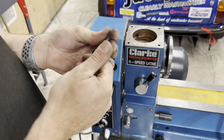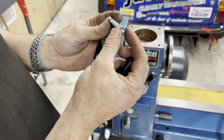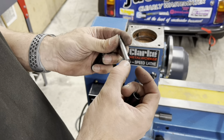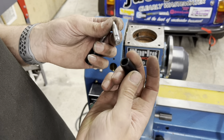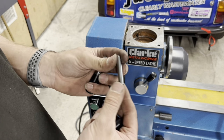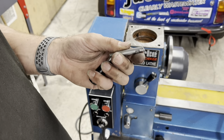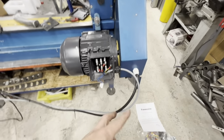Another quick job I've got to do is these handles — which are M6 thread. All I'm going to do is turn that in the lathe and put an M6 thread down them just to replace the two little handles that are busted. Nice simple job — I'll just turn that much in the lathe.